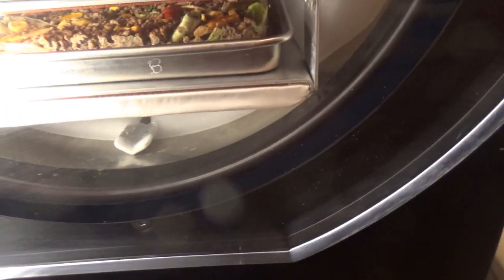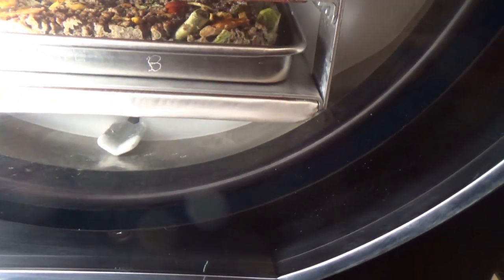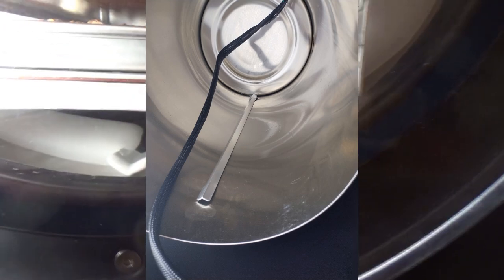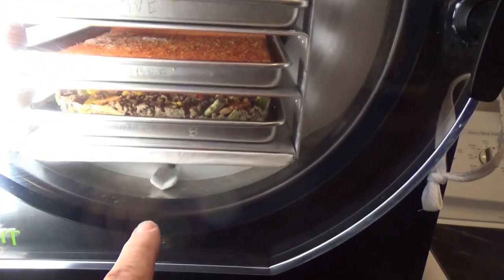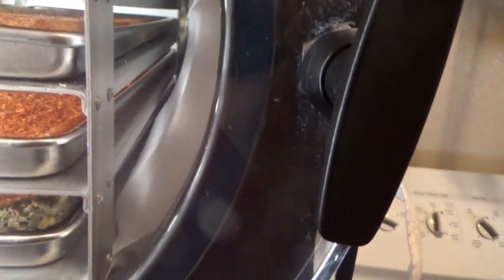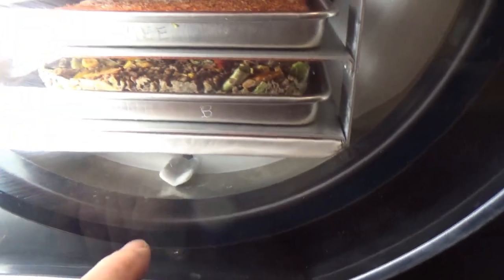In the bottom of the chamber, you can see I've got a V piece of a 1/2-inch aluminum angle that runs front to back, and you can see that the ice hasn't formed over the top of that V. That will allow for the water to get from the front to the back into the drain without having any flooding coming over the front. And as you can see, this particular run has got quite a bit of ice buildup in it, and that would obviously mean potential for water out the front.